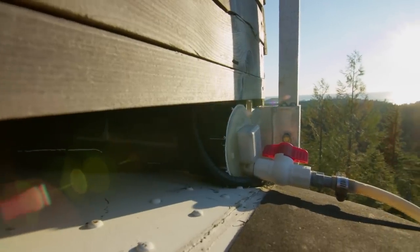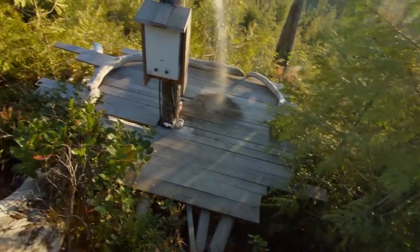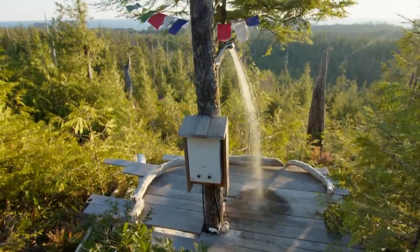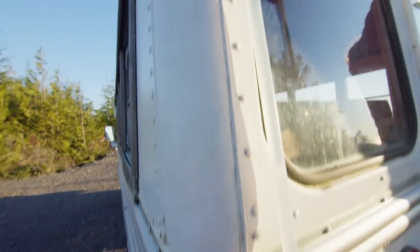I've got four 12-foot long 4-inch PVC pipes that run underneath the deck, painted black to help with absorbing heat. The idea was to have warm showers on the road, but because I'm living more permanently now, I built a shower platform and rerouted it underneath inside into the top, so I use it for dishes and stuff for a couple weeks before I have to fill up.